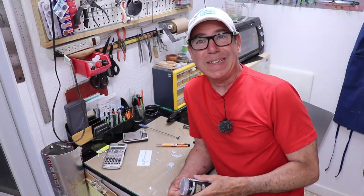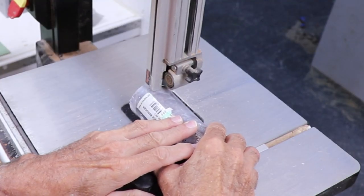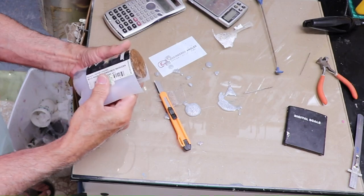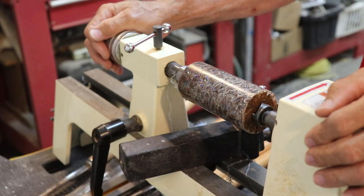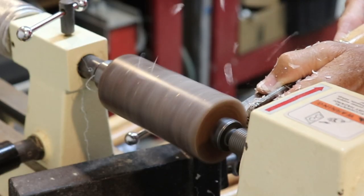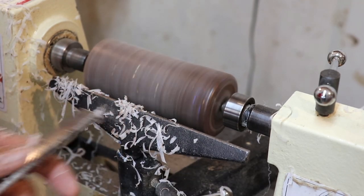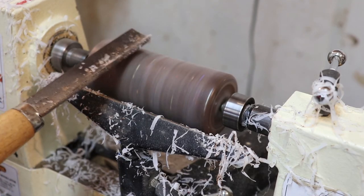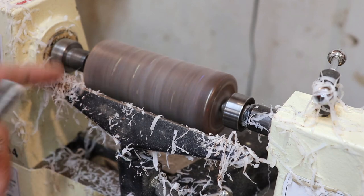It's been like five or six hours — I left this thing all day and it's set up. I'm not sure what this is gonna look like when I open it up, but I'm gonna go ahead and take it to the saw and cut out the little piece of metal mesh. Look at this thing — it looks like a sausage. Let's cut the casing off. This is so bizarre looking. Let's see what happens when we try to lay it down on the lathe — I got a feeling this is gonna smell delicious and look kind of turd-like. A good way to tell if it's true is to set your tool on top — you can see it bouncing and hear it, and as you get to this end it's a lot smoother.